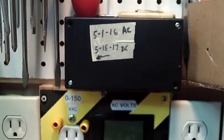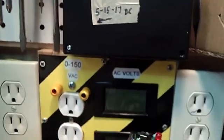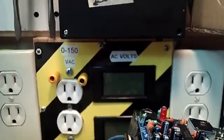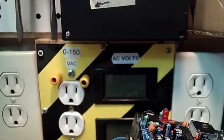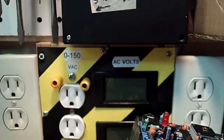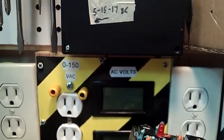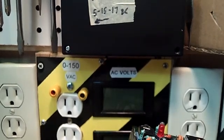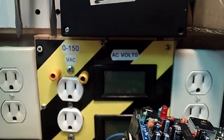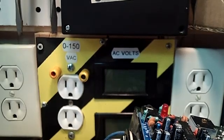And I think it's less than 15 milliamps per meter that they're required to operate. So I would say the wall wart will probably put out over 12 volts pretty easy, probably closer to 13, 14 volts. And if nothing else, I can just use 9-volt regulators. It's not a big deal. I'm just trying to find the happy medium to operate those and get away from the batteries at the same time.